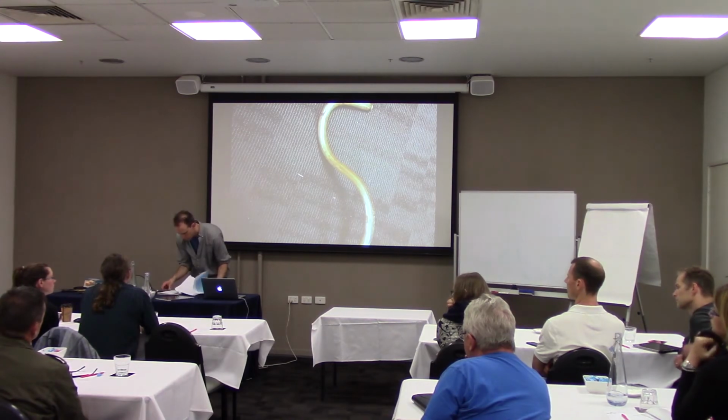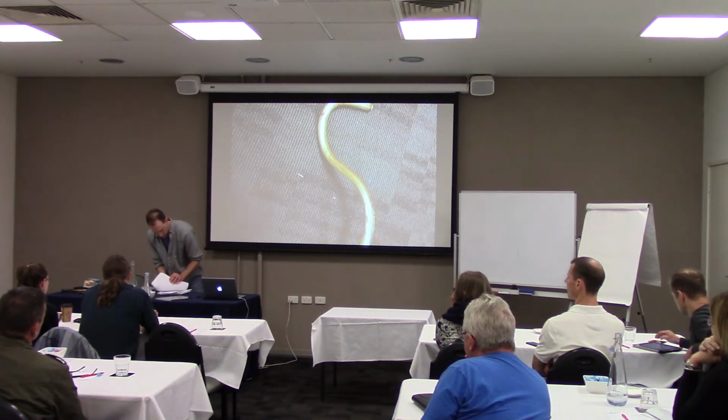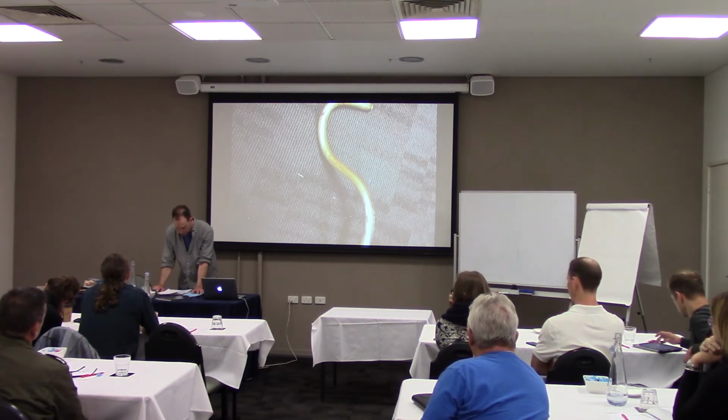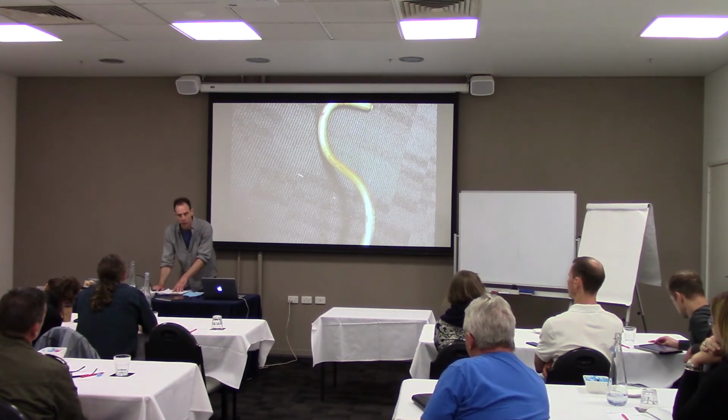This article that I told you about, James Moss, yeah, I have that here, and he actually goes into it. He was using calcium carbonate, like chalk dust, and mixing it into a solution that he was using to clean the parts with. Yeah, that's what saxophone makers use, I think, with a bit of oil and chalk between the posts. And mineral spirits. Yeah, that's what they use. And then Stoddard's solvent is another one. It's pretty safe for brass.